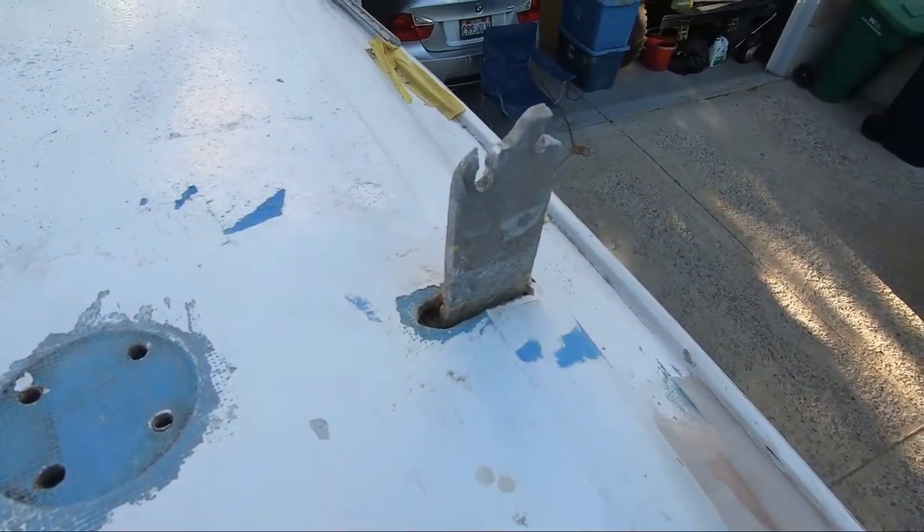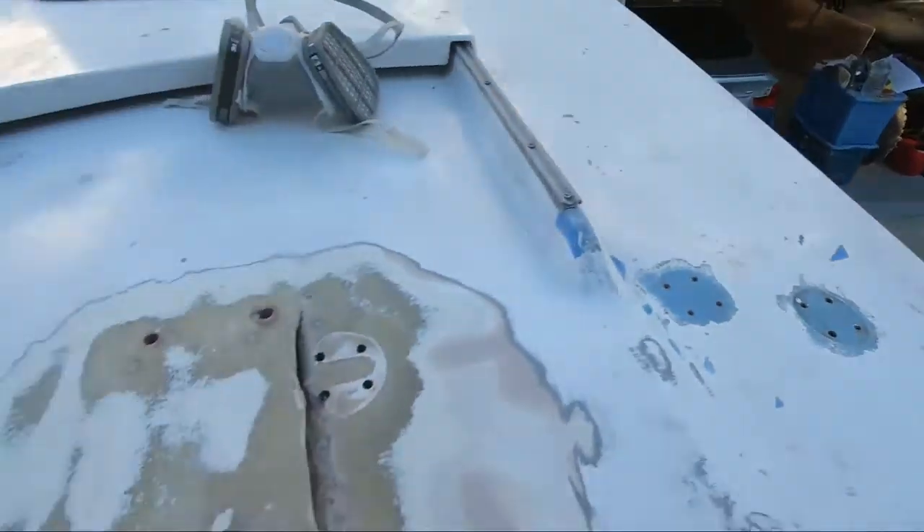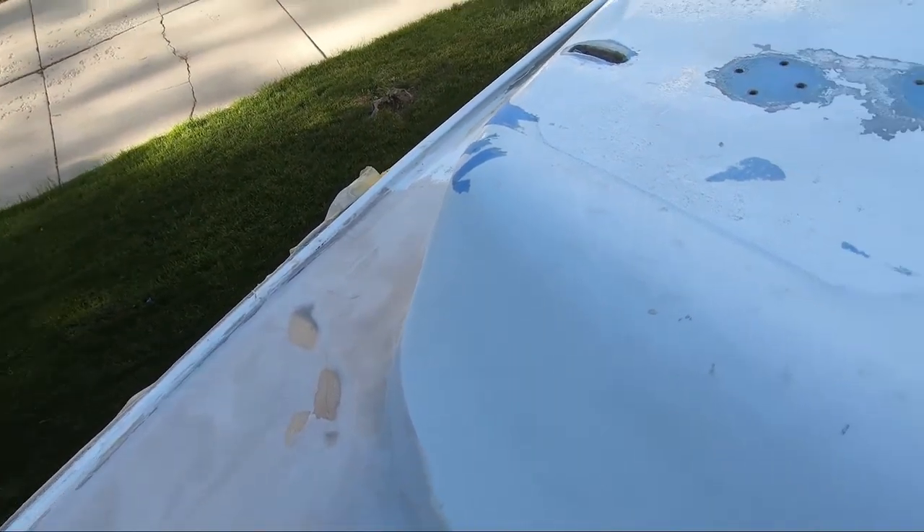But there it is — the next major repair. Still have the chain plate remnant down in that hole to get out, and still have that one to get out too. I'm almost done with the putty, just one little bit in that corner to finish. I'm going to leave this open for a couple of days now since it's supposed to get nice and hot — see if we can cook the last of the moisture out of this top part. Then I think we're almost ready for primer, seal this thing back up, get rid of my plastic topper, get the windows put back in, and get the topside painted again. Closing in on being done — that's what I keep telling myself. Gotta have faith.